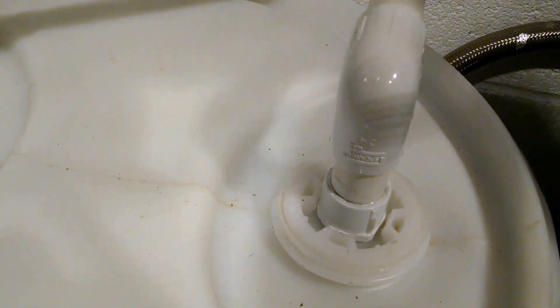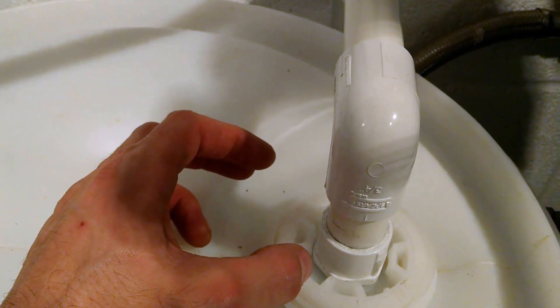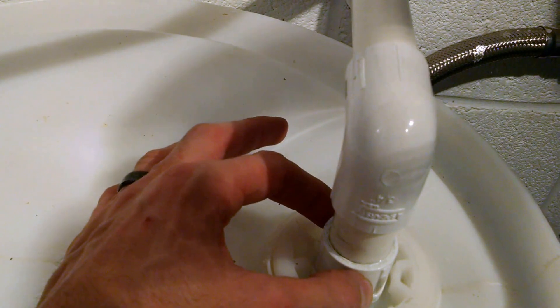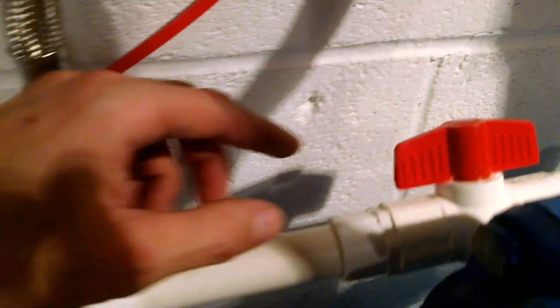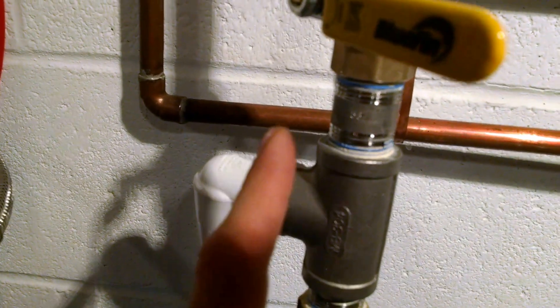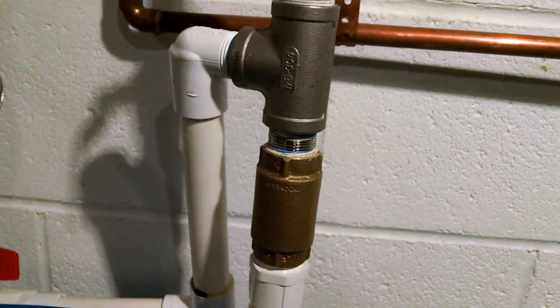Now on the other side, this is the suction side. I have a 2-inch opening with a ¾-inch female, so I punched out the other end of it, and in this case I had to do some pretty serious finagling. I took a ½-inch piece of PVC and whittled the end of it down so it would actually fit inside of this fitting — a ¾-inch male fitting — coming in the underside and glued into the inside of that fitting. Then you have a ¾-inch piece of PVC coming out the other end. This is my suction line, and I've got a ball valve here so I can isolate this suction line and choose between this side — the rain barrel — or this side, the waste barrel. This is a ¾-inch check valve I just put in. It's required in order for this thing to be automated; I had to do it manually before. Now that I have a check valve, I can just set it and forget it — my pressure switch can control the situation.